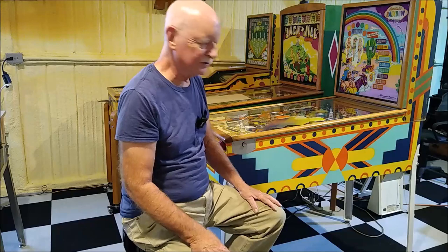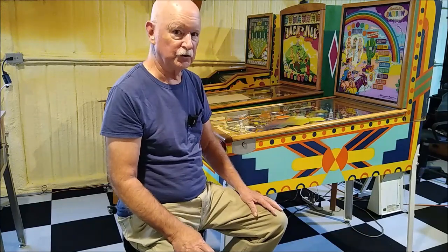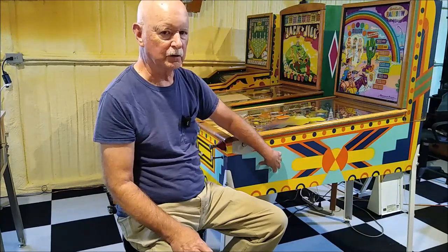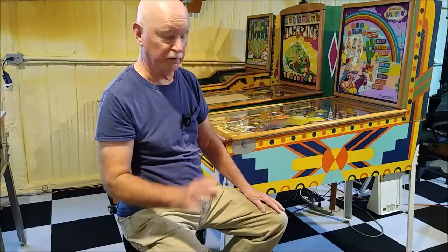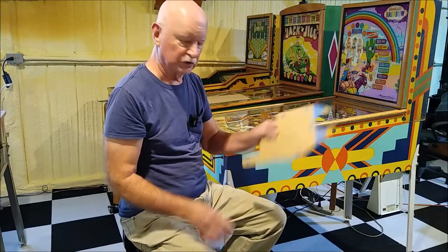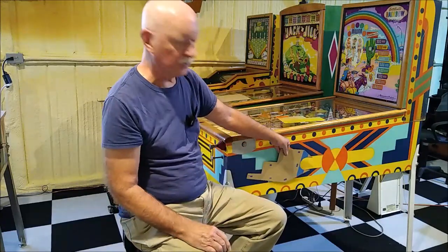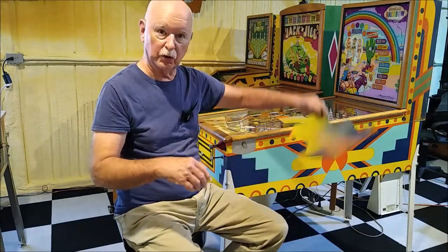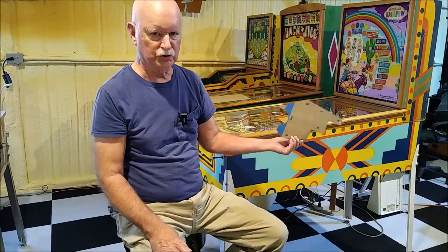That is the essence of this technique. All the work is in the preparation of the stencil — you'll spend time drawing the tracing paper shapes and quite a bit of time cutting your stencil. Once it's cut, it goes very easily. You don't have to pay much attention to anything except getting the right color and taking the right panels off. And if you're doing both sides of the cabinet, you can use the same stencil — just take the tape off when you're done with one side, flip it over, and it becomes the mirror image. Put it on the other side of the cabinet with the paint side facing the cabinet, and you have your mirror image of the pattern. You paint it just like you did the first side. So you only cut the stencil once — you don't have to cut two stencils.